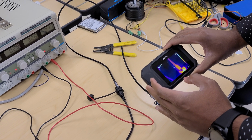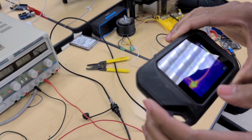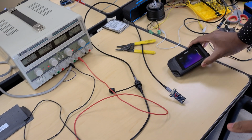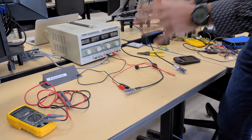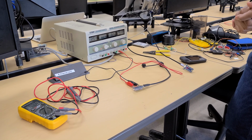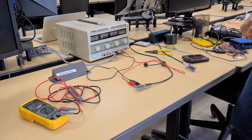And the voltage drop that we're measuring is pretty substantially low. So as long as we build a decent PCB around this, pretty much done with this, we should be good. And yeah, so I think for the most part, USB-C should have no issue with roundabout 6 amps. The voltage drop that we saw here is rather low, to the point where I think that this should work